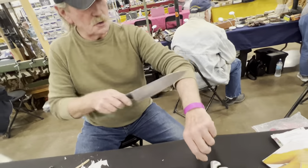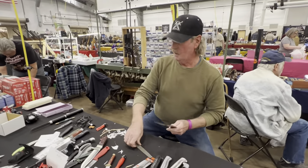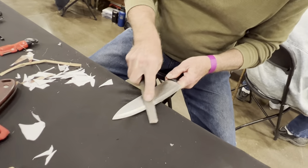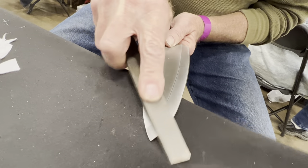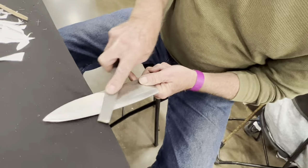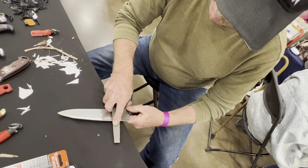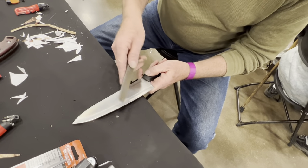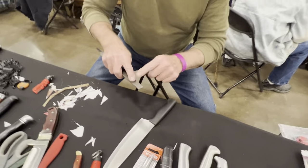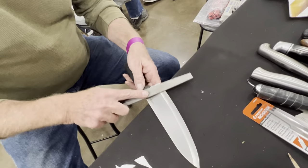Okay, it's about that sharp — let's fix it. Now, this really is hard stainless because the file really doesn't want to cut it. So I'm running at an angle this way, not this way, although you can do it that way — it's just harder. I'm choking up on the file so my finger is right here so it doesn't move. If you're back here, it's more flexible.